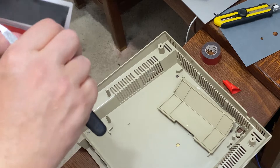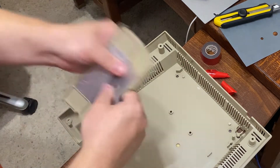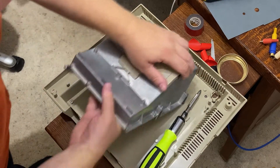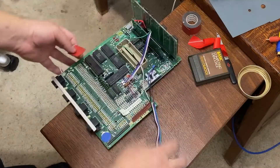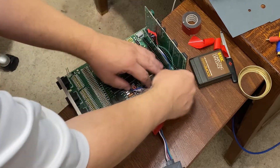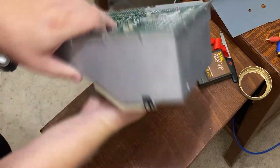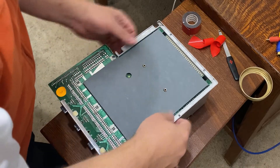Although I took a long time just trying to get the red backing off of this double-sided tape. The metal shielding is back on the door. Now it's time to put the door back on — the rest of the metal shielding, the tab installed, and I was being careful with that spring. I ended up having to go to another YouTube video to watch someone else learn how to assemble this thing. I couldn't run the audio-video cable out the back, so I decided to run it out in the same port as the power switch, which gave me the most room to still mount the shielding to the case.